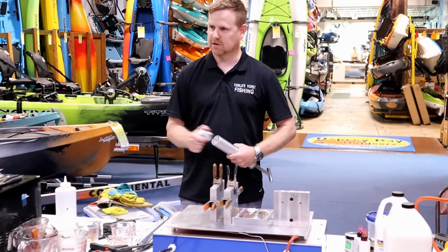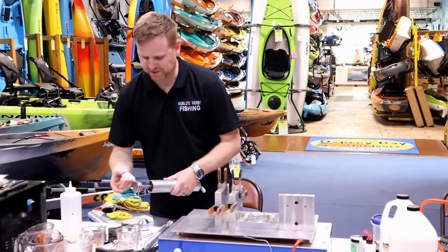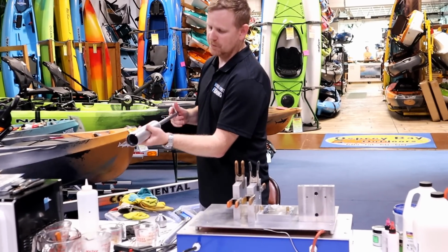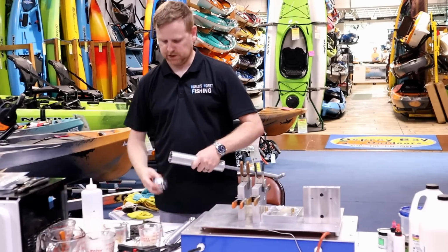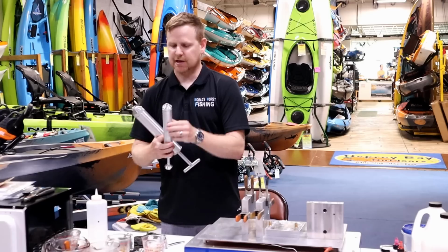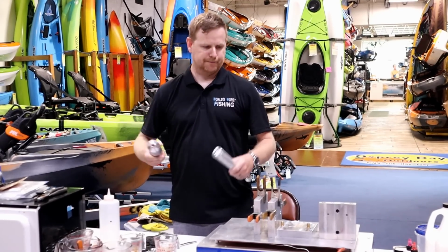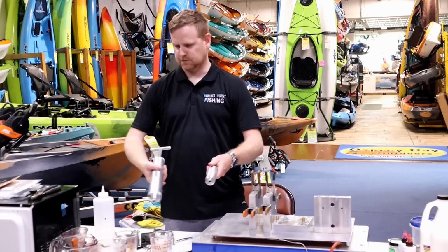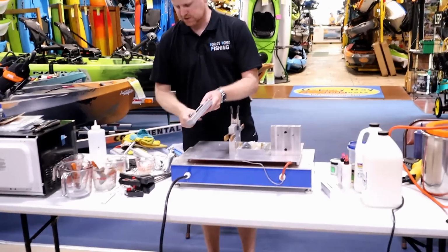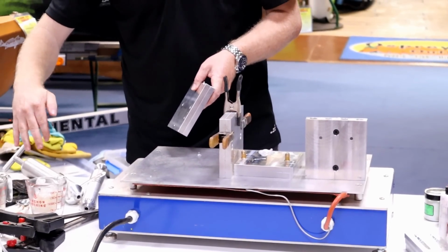Now, a table surface like this would absolutely require some cleaning. Sometimes you spill pigment on it or glitter sticks to everything. But the actual plastisol material comes off pretty easily. Pretty much any surface. So in that sense, it's a very efficient material to work with. Z-Man stuff would be just not as user friendly. You can see right away how user friendly this stuff is. It cleans up easy, sets up quickly, and you can reuse it. All of these little parts can be reused, okay?